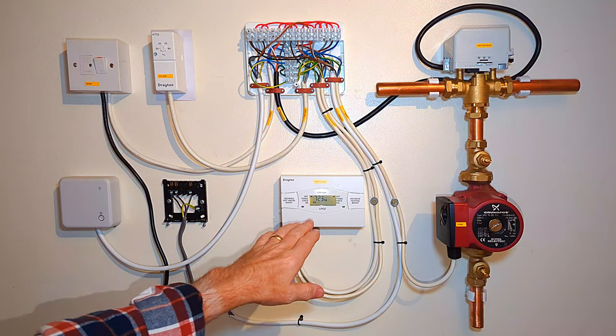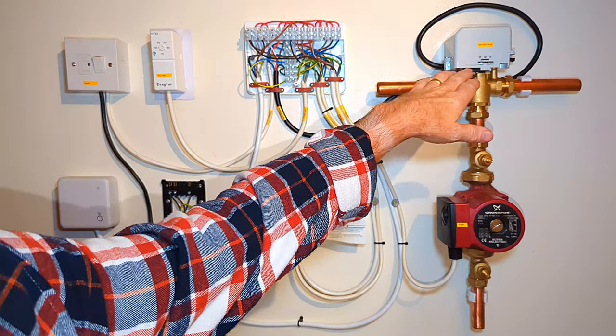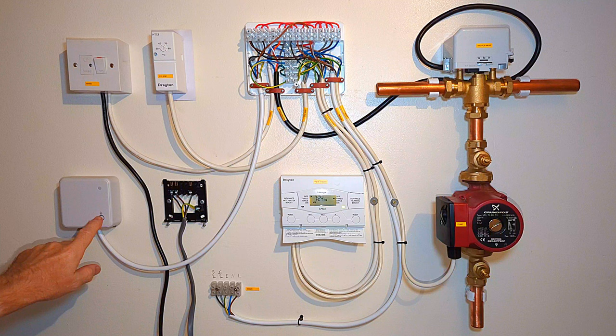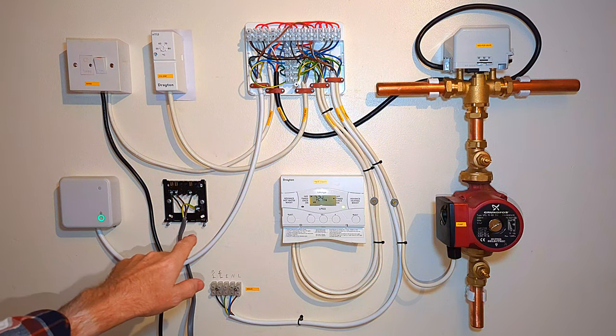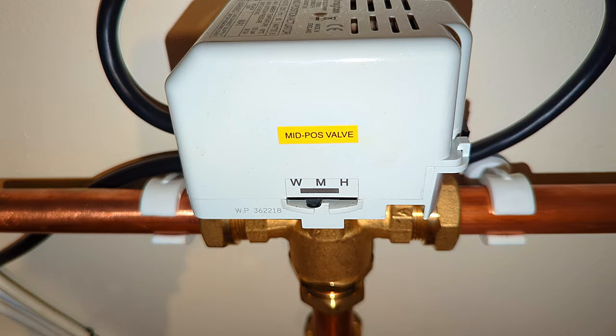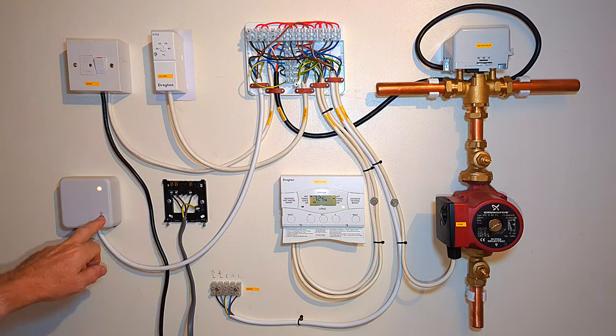I select central heating on and there's a green light, but the central heating won't run yet because the new receiver unit isn't telling the heating to come on. I can test the wiring by pressing the button on the receiver unit - pressing that button now turns the heating on. I can see the mid-position valve moving over and opening up to turn on the central heating - all good. Pressing the button again turns the central heating back off; the green light stays flashing for several seconds until it turns off. The mid-position valve stays in the heating position until hot water is selected, but a zone valve will close immediately when heating is turned off.